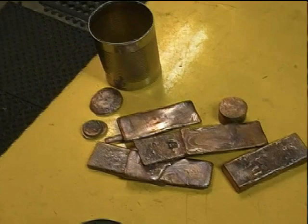You can melt many of the non-ferrous metals up to about 1 to 1.5 pounds using a graphite crucible. One guy I saw made a nice temperature-controlled solder pot, well within the power of even a 1,000 watt unit to melt a pound or two of solder. Examples of materials that melt well are copper, aluminum, gold, silver, lead, tin, brass, and most bronzes.